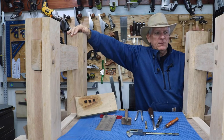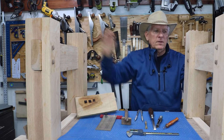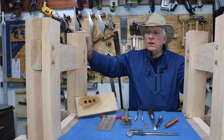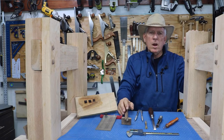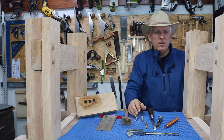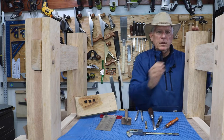I recently, working on this Samurai Carpenter workbench, had to do 32 pyramid plugs. They are primarily cosmetic — normally they will be, because you will have either driven screws or done something else to secure your work. In this particular case, I put a black walnut rod through all the way and used draw boring to pull things as tight as I could, but then purposely left a half inch depth so that I could insert some decorative pyramid plugs.